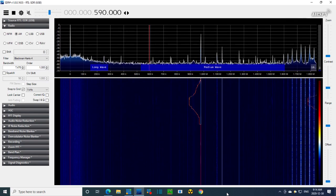That's because I monkeyed with the signal tracer. It was better when the signal tracer was ringing. There it is. So I'm hearing the audio heterodyne between two RF signals. I believe that's what I'm hearing now. So we got two RF signals very close together, 1,000 hertz apart. Well, wait a minute, is it heterodyning? By heterodyning, I mean as you vary one frequency, the difference changes between the two frequencies, you hear the difference changing. So that's not at all what we're after.